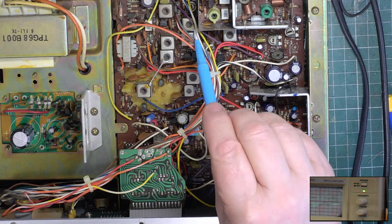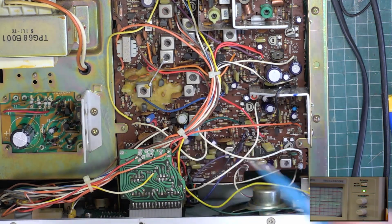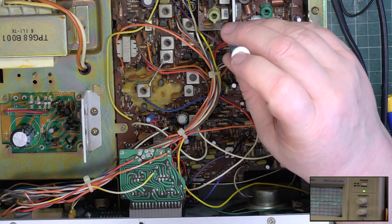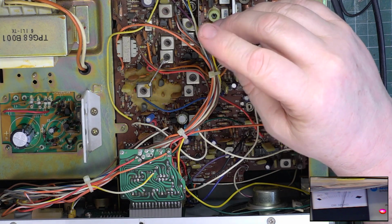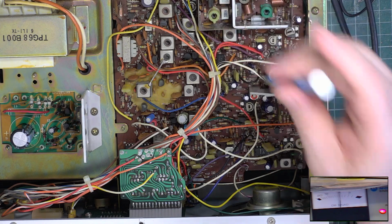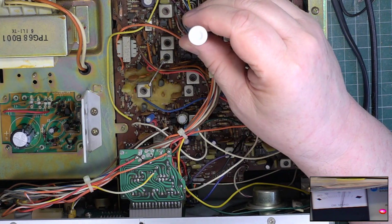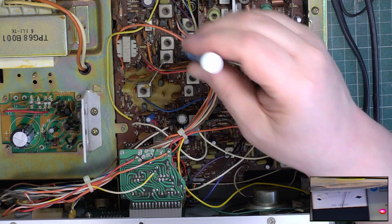Right, here we go. You get the extra coil in the base station, and you get the other extra one. I think it's that one. So you get the extra one. So we'll just get that to about 4 dB, so we're not saturating the receiver. See if we can get any improvement. Just put it over the SINAD meter so you can actually see what I'm talking about. Well, look at that. Drop the signal generator back to 4 dB. They're spot on.